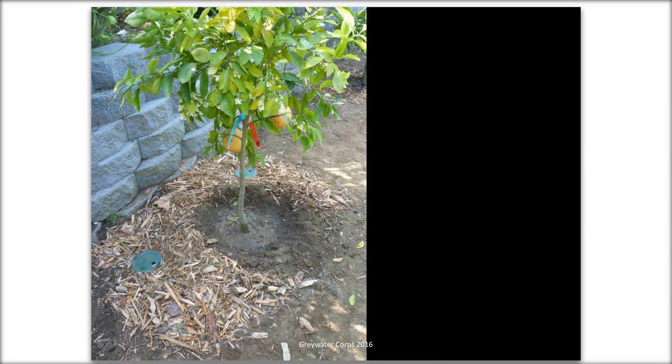They allow it to percolate out horizontally. And they also kind of filter gray water. So the percolation aspect is, if you have drip line, you've got hundreds of little emitters all over the place, or if you're spraying gray water, you're not allowed to spray it. So you're dumping a lot more water into a limited number of outlet points. The mulch will allow the gray water to spread out laterally, horizontally through the landscape.